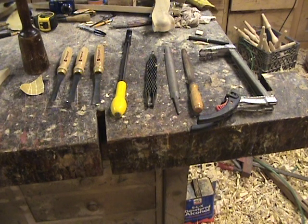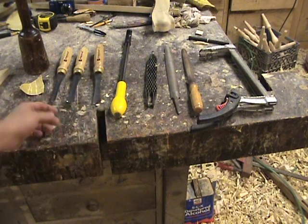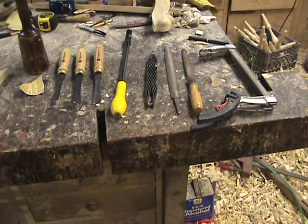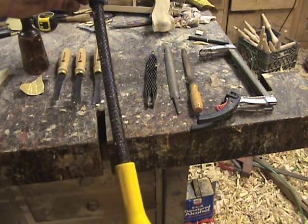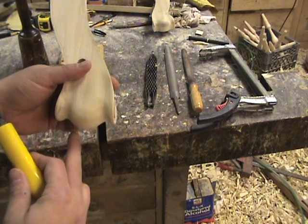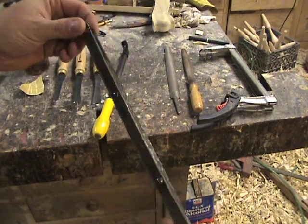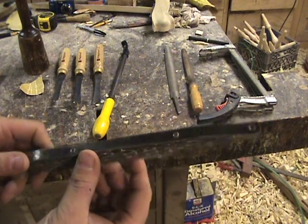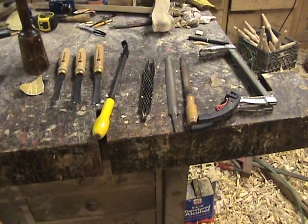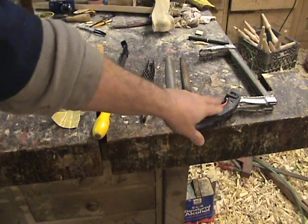The way I do this is I use three basic carving tools. One has a pretty wide sweep, the second has a slightly shallower sweep, and the third is small but has a pretty round profile. There's also a short form that gets down into all the convex areas and does a lot of the work on the tendons. The next tool is called a Shinto Rasp — basically a series of bandsaw blades with a coarse side and a fine side. This works really well for hogging out material. Then I'll use a couple of hand files, a piece of 80-grit sandpaper, a carving mallet, and a couple of clamps.